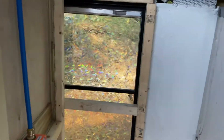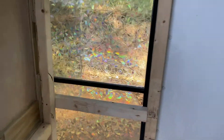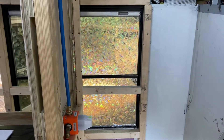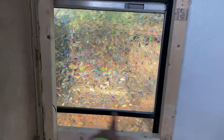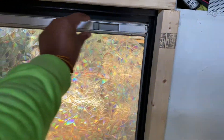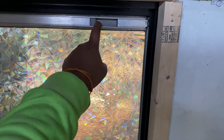Moving on to framing the window. You might say it's already framed out — well, basically it is, but I need to add more studs. So I think I made my decision. I'm going to put a two-by-two here, here, and up here to cover up the opening area, because I only want the glass seen.